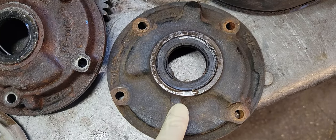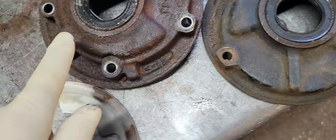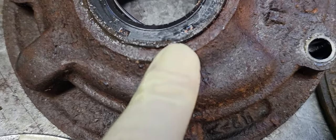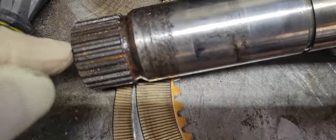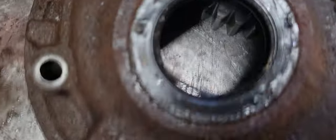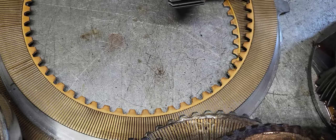What's interesting here is this is the old-style Velvet Drive pump, before they went to the guard on the front. This is the aftermarket pump without the guard, and you can see the seal was starting to walk out — but there's no seal surface. Somebody replaced the pump on this transmission, but how is the seal going to ride on that? They didn't countersink the seal or try to do anything.